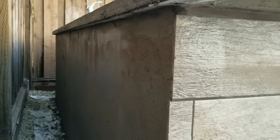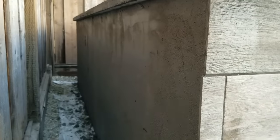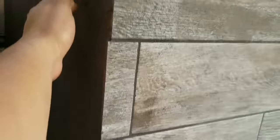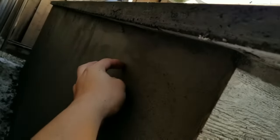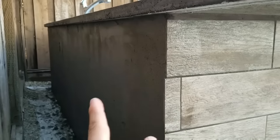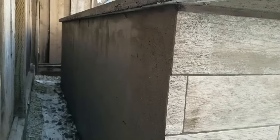I finished putting my stucco all the way around. Now I'm grabbing my sponge. I let it dry maybe about 20 minutes — you know you can't make an indent when you're pushing it. Just grab your sponge, make sure you wet it. You can see I did this first part here. You don't need to be perfect; just have enough coverage of the stucco, because with the sponge you can bring all the aggregate out and smooth out the imperfections.